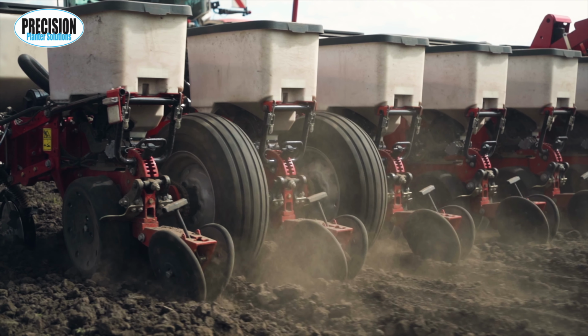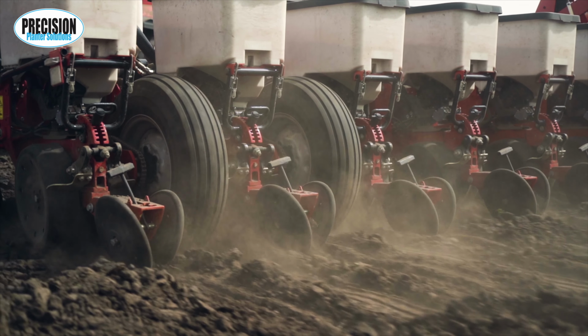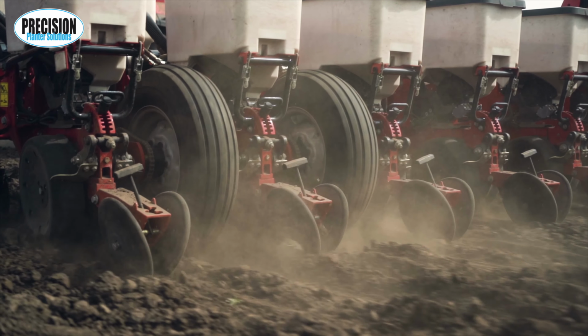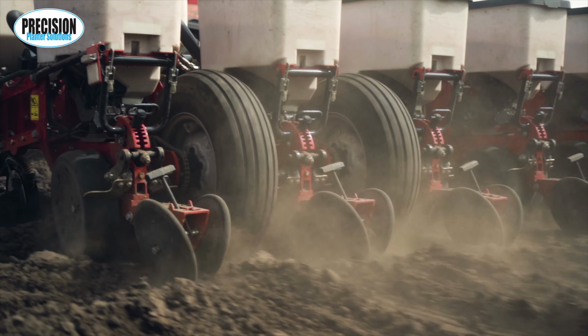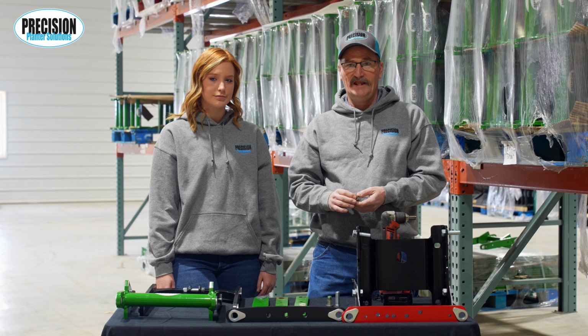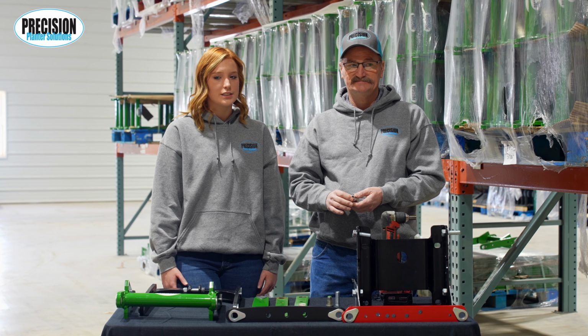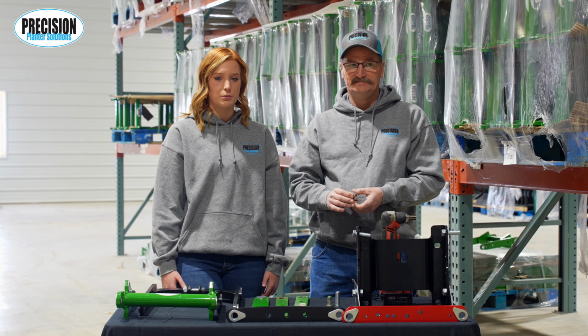In the last several years, many farmers have upgraded to hydraulic downforce and high speed on their planters, which requires more down pressure to keep the row units at the intended depth. This has been hard on parallel arms. Many farmers started with fairly tight row units when adding the hydraulic down pressure, only to find the following spring when going over their planters that there was excessive wear on their parallel arms. It just doesn't make sense to have thousands of dollars worth of precision upgrades on a row unit that moves and shakes in every direction.